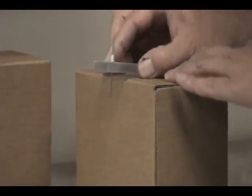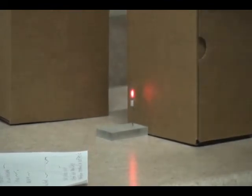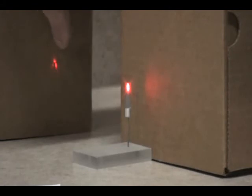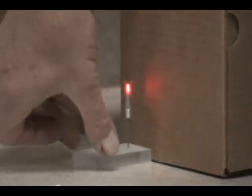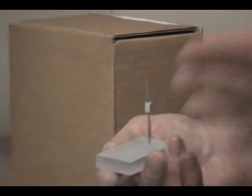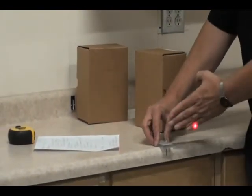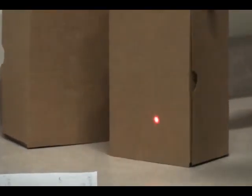If it's on a surface, bump the pin up against it. On a full-height cabinet with a bad angle, you can put two pins up against it and simply hit the point there. On the tapered pin, raise the laser until it fits in its tightest position on the taper — you can see a little reflection where it's going around both sides. Because you can't hit the actual side of the full-height cabinet, you hit two pins, and the offset is exactly a half inch from the end. You just offset that line over one half inch. The rule of thumb: do not let the dot get bigger than a circle — at that point it's about 10 degrees.